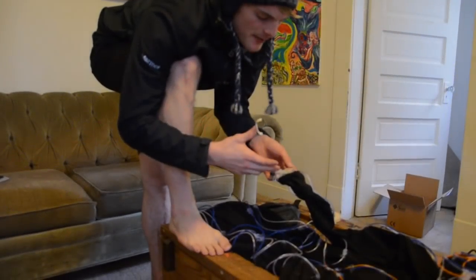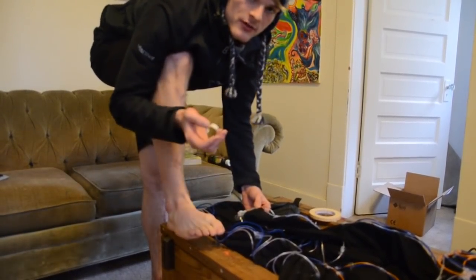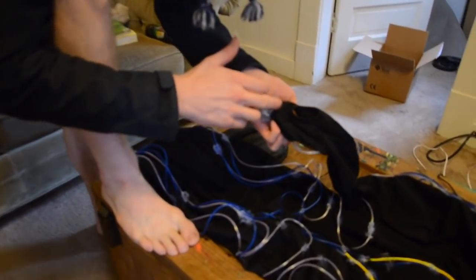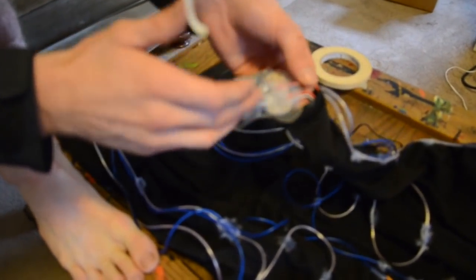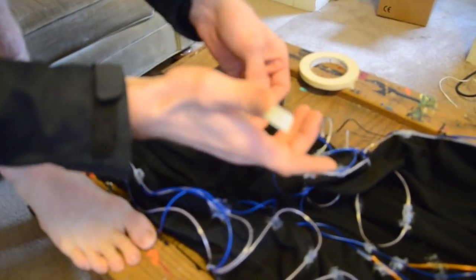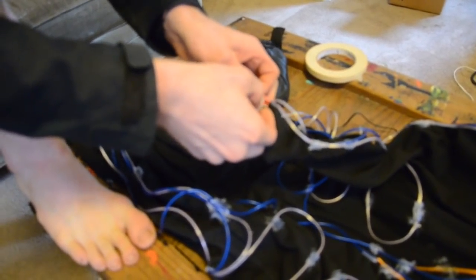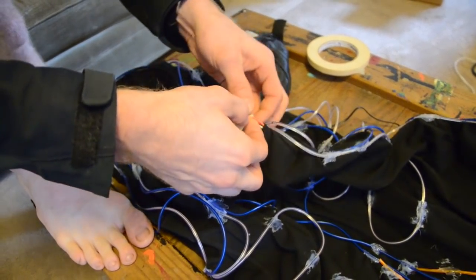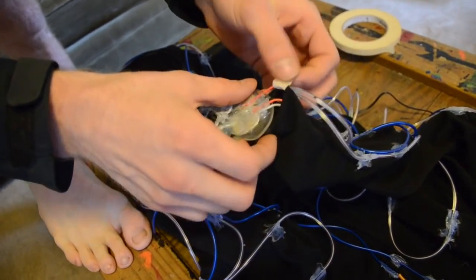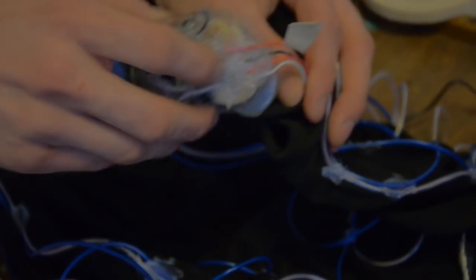We had a problem with the suit. One of the controllers got slammed in a car door, so we had to replace it. We just wanted to go over some good ways to troubleshoot and diagnose what's going on with the suit. Some of these buttons were broken here, so we're going to replace this whole interface, this module here. Before we clip the wires and restart, you're going to want to tag which one is your lead power in. This will save you a lot of trouble memorizing what color is which. So once you have your power marked with this handy masking tape, go ahead and clip your wires, and we're going to re-solder them to here, and hopefully that'll get it working again.